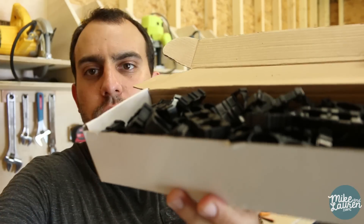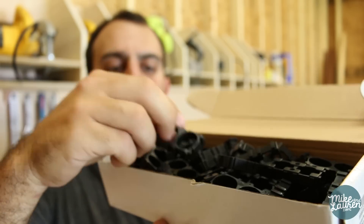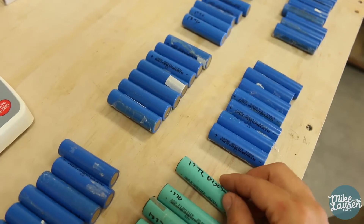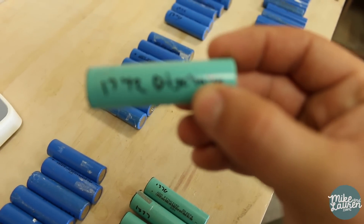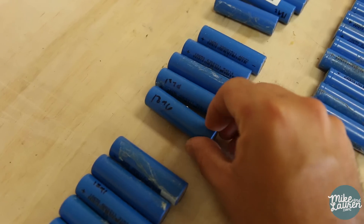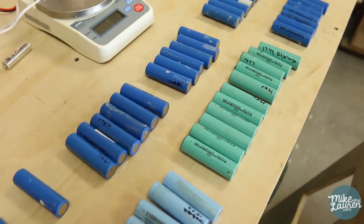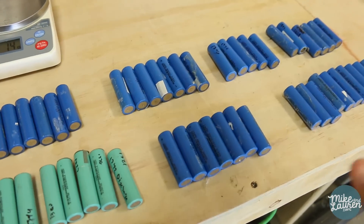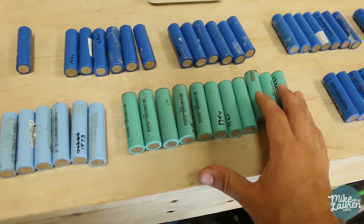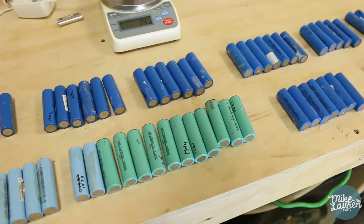I also waited three weeks for these little plastic connectors to come in from China — they attach all the 18650s together so you can put them into one nice solid pack. After removing all your batteries, you want to discharge each one individually with the IMAX and record its capacity. For example, this one is 1,742 milliamps, 1,896, 1,892. The reason is you want to group like capacities together — in one cell group you might put 12 batteries, but with cheaper ones that have less capacity you might add a cell or two so all six groups are balanced for charging and discharge.